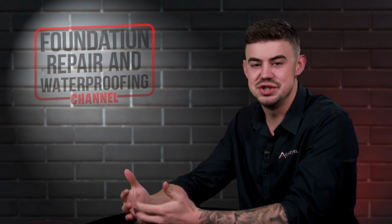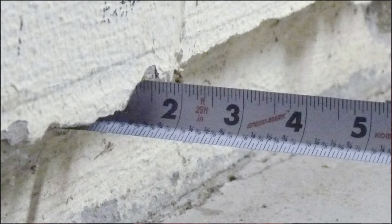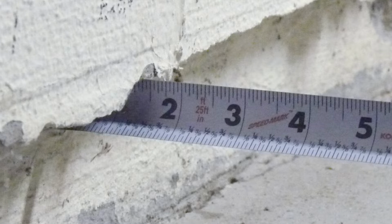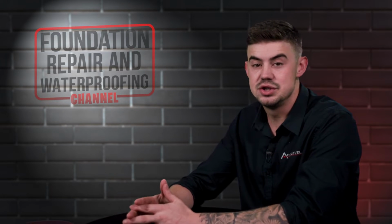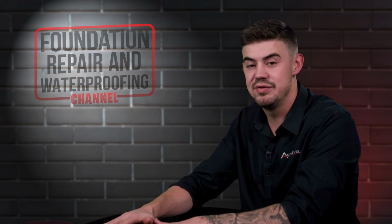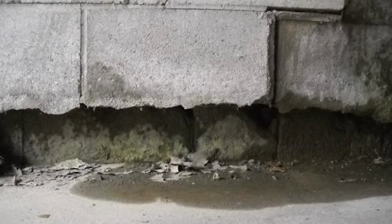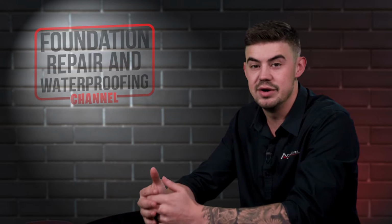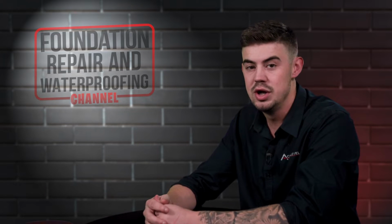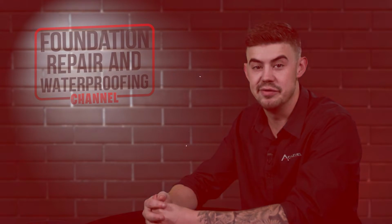What is foundation shearing? When we're talking about foundation shearing, we're talking about when a basement wall typically shifts in, and how it's shifting in. It's most commonly found on a block wall where a block will physically shift directly on top of another block, creating a very sharp edge in that basement wall, allowing that wall to slide in even further.